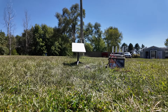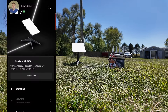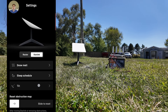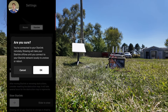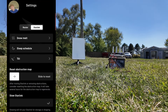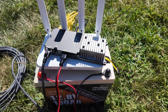I know what you're going to ask — can you still control this thing through your Starlink and do the shutdown and stow of the dish through the Starlink app? Let's take a look. It says it's connecting, it says we're online. I'm using the WR1800K network. Let's go into settings, Starlink, slide to stow — and it's going to disappear. It's asking me because it thinks I'm connected remotely, since I'm actually using my phone to go to the router to the cloud and back down to the Starlink dish to control it remotely. This is perfectly normal — just plug it back in and it will unstow itself. And she stowed. When it comes time for bed, there's an on-off switch down here — just hit off and that will save your battery power.